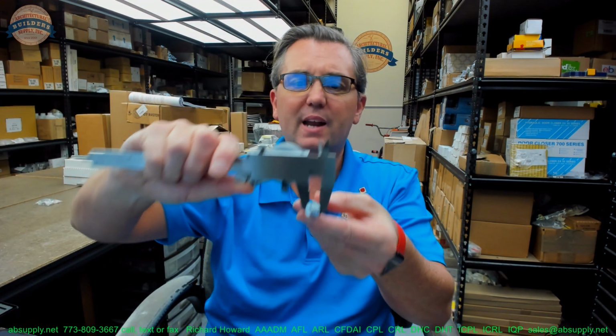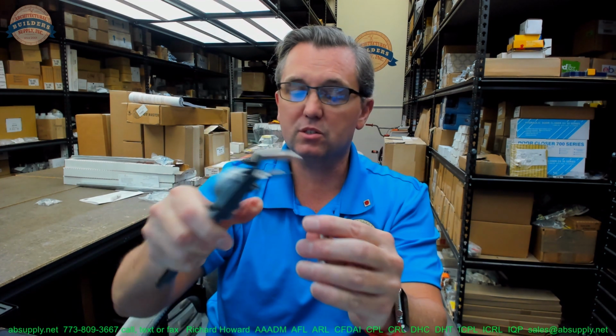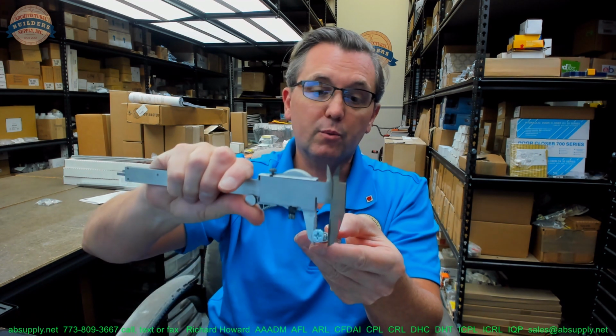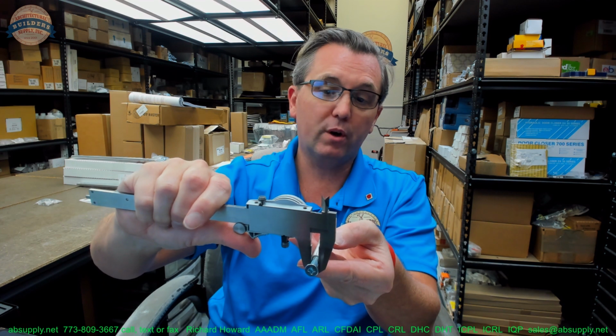Okay, now to wrap this video up, just a couple of basic dimensional properties. I had said 3/8 on the female side and 1/4 on the opposite side, and that's certainly what it is. Putting a caliper on the body, it's 0.372, so 3/8 is going to be perfect. The OD of the head is 0.531, so that's good. We know that this is a 1/4-20 bolt, and that diameter is 0.245. If you're going to get into wire-sized drill bits and drill 20 thousandths larger on this side, that would be okay.